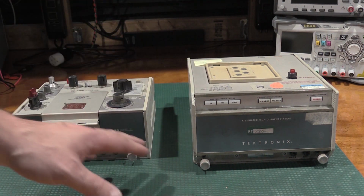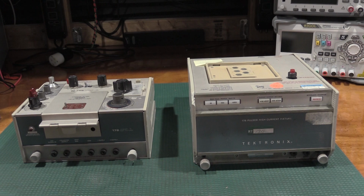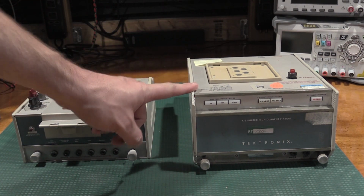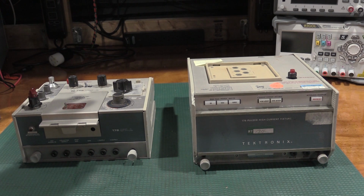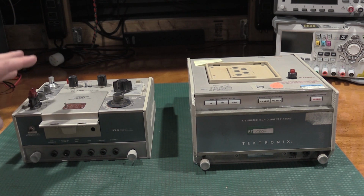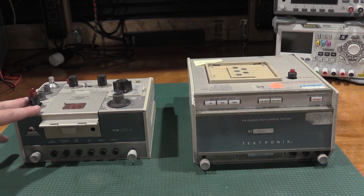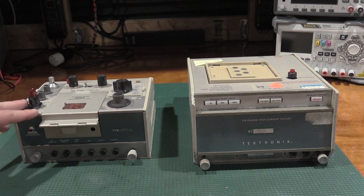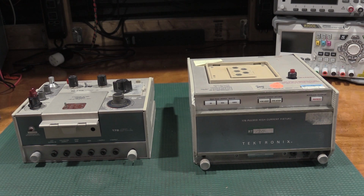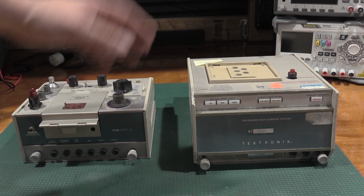So the power bands of the two curve tracers overlap quite a bit, but the 576 is geared for high power devices. The 577 is geared for small signal devices, op amps, transistors, things like that. Which is also a little strange because the 577 gives you 100 more volts on the collector. So that's a little odd too.